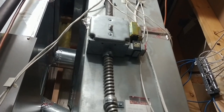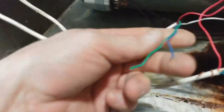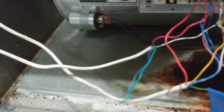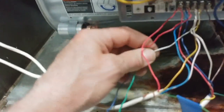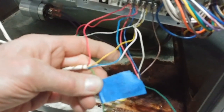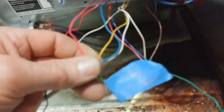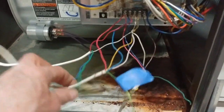There's a small transformer just working the humidifier load, mounted right there. Then there's a four-wire run — the two-wire outdoor sensor on the humidifier water panel is wired to blue and green going out to the air conditioner, using the other two for Y and C at the AC. Then we have our thermostat wire going to G on the furnace. Just making notes so I know how to put it all back together.